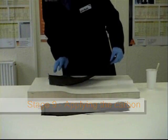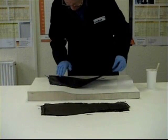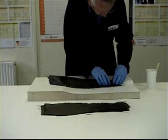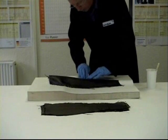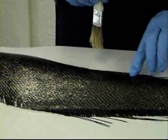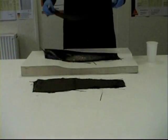Carefully apply the first layer of 200 gram weight carbon fibre. This is going to be the layer that everybody will see, so you really want to take your time getting this on correctly. The laminating resin that we applied to the gel coat will be a little bit tacky, so you have to be careful. Make sure you get it in the right position and then just press it into place very gently. Work in those corners and edges because they'll be the tricky spots — they'll be the spots where you're more likely to get an air void. When you're happy you've got it into place correctly, just apply a little bit of resin with the resin brush, stippling through the wet resin already applied, because you want the ratio of fibre to resin to be more on the fibre side to give a nice strong laminate.